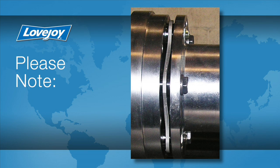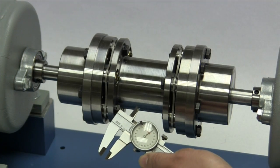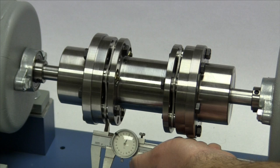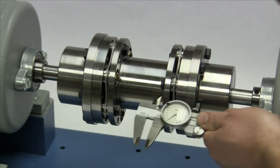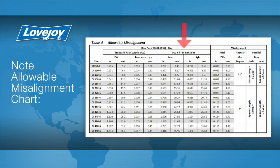Finally, check the disc packs on each end of the spacer assembly. There should not be any visible distortion in either disc pack once the bolts have been tightened. If there is any waviness in the disc packs, the axial alignment of the equipment will need to be corrected prior to continuing. It is a good idea to recheck the angular and axial alignment before continuing. This check can be done using vernier calipers to measure the gap between the guard ring and the spacer flanges. This measurement should be taken as close as possible to the edge of the hubs at four different locations — three o'clock, six o'clock, nine o'clock, and twelve o'clock — without rotating the coupling. All measurements should fall within the PW high-low range specified in the installation guide. If any measurements fall outside the allowable range, you will need to realign the equipment to correct this condition.